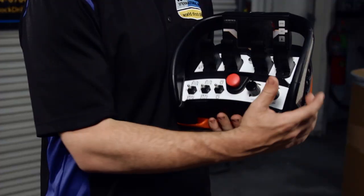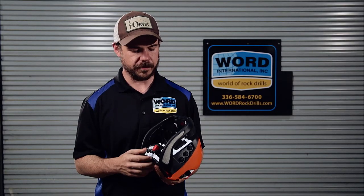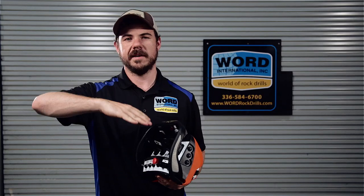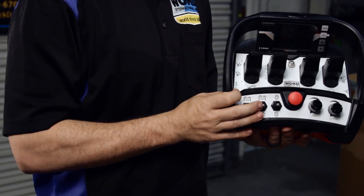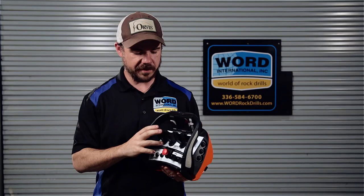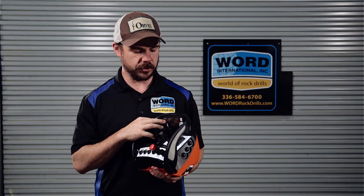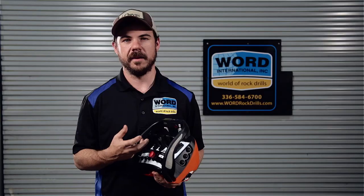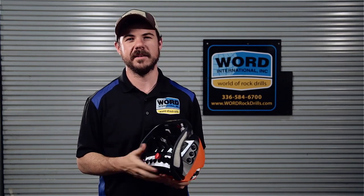If you have a hydraulic percussion drifter, our hydraulic percussion button is on the side. We'll preset the valve bank, so all you'll have to do is just hit the button to turn on your percussion. That is also engaged in auto drill. Our 360 paddle works two different ways. You can utilize the first axis for our drill mast — moving the paddle up and down will either move it to the left or the right. But if you hit mode A or mode B, this also works for our second axis, which will move the drill to the left or the right. Keep in mind that if you can only use one and you have both installed, make sure you hit the mode A or mode B button. On our newer radio remote controls, we've installed pressure sensors and inclinometers on your unit, so you can see your pressures on your display screen, as well as what level you're drilling at and what degree you're drilling at — be it 90, 45, or 15 degrees.